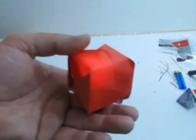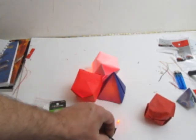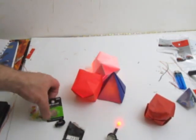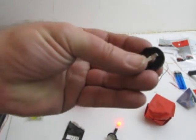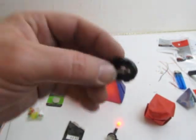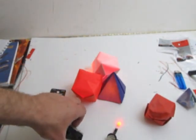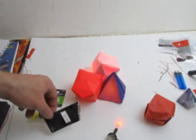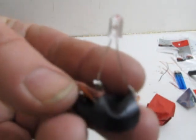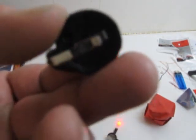Here let me show you real quick — there's a couple of things here. This is a little setup that I made. You need a 3 volt battery like this, a little battery holder — I think it's called a battery cell holder — costs like a dollar. And you need a resistor, or the LED can burn itself out. I use 100 ohm, 1/8 watt. And you need an LED — you can tinker around with some different types of LEDs to get bright ones, even different colors. I just solder them together into a unit like this.